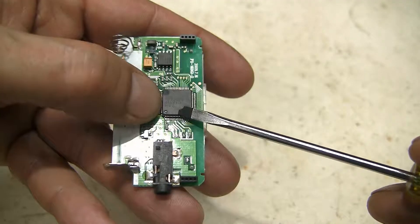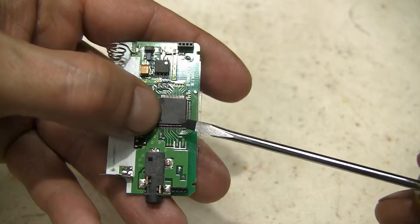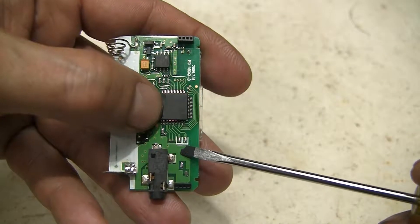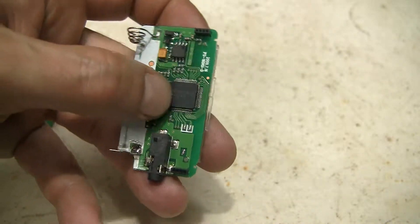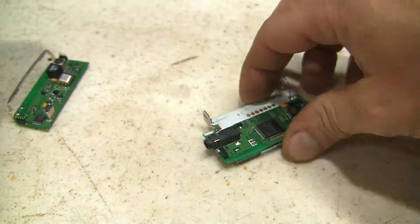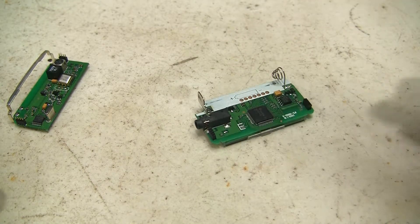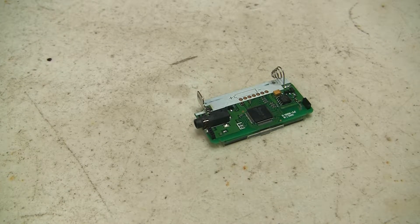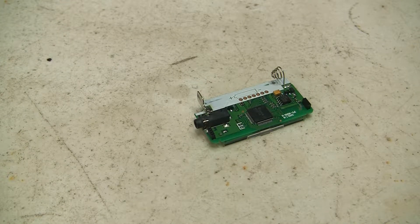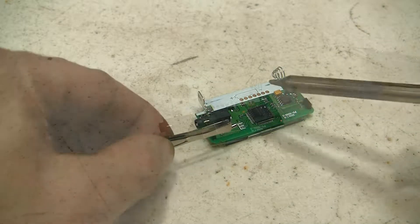And finally, this chip is a Texas Instruments microcontroller — also a 96-segment LCD controller and display driver. When I got out the magnifying glass and counted all the pins, I found that two pins are supposed to be the oscillator, which matches where our component was. So I've got my soldering iron out — I've had it since high school, mid-90s — and she still works. I've got her heated up and I'm going to try to get the crystal attached back onto the circuit board.